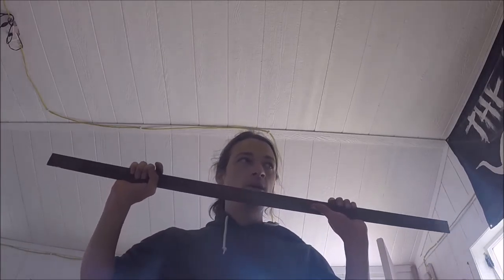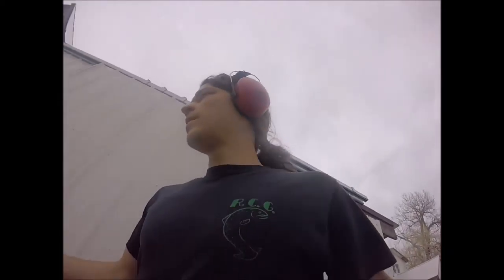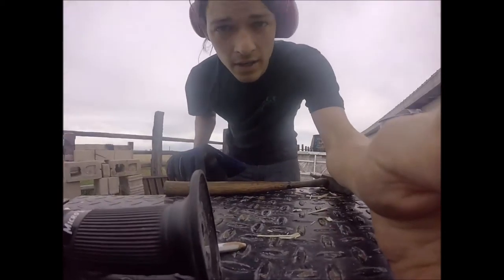So I've just got some footage that I'm just talking over. I started with some 5160 steel — it's pretty thick, so it needs to be drawn out, it needs to have a distal taper, and then I have to make the tang and everything. I just cut out kind of a tapered blade and then drew out the tang.